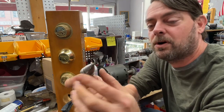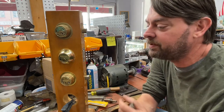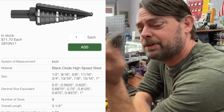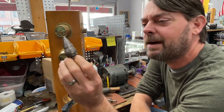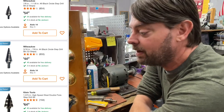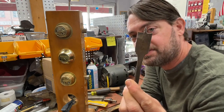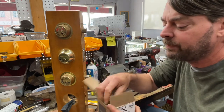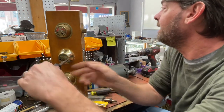But we're shifting focus to retrofitting older locks on wood doors. There has always been a problem in that there's no real affordable step drill bit for this — the one from McMaster-Carr is like 70-80 dollars with shipping. The ones at the store all go past one inch. We all know the standard one-inch hole for latches, but back in the day Schlage favored the 7/8-inch hole, and that is a problem when switching out locks.